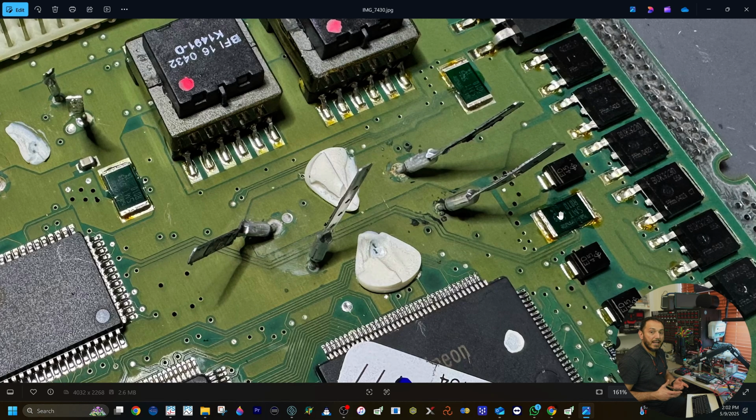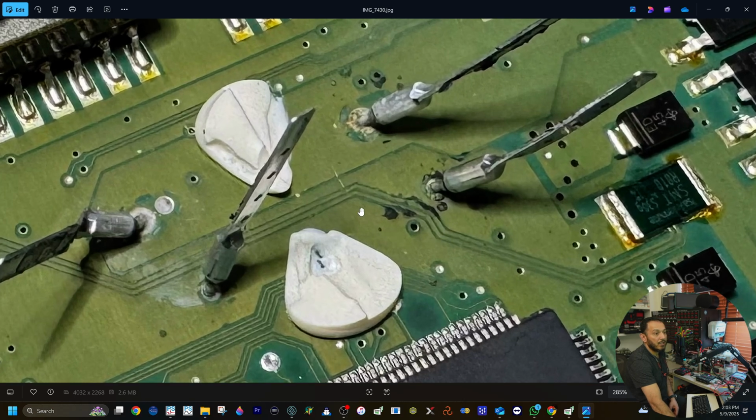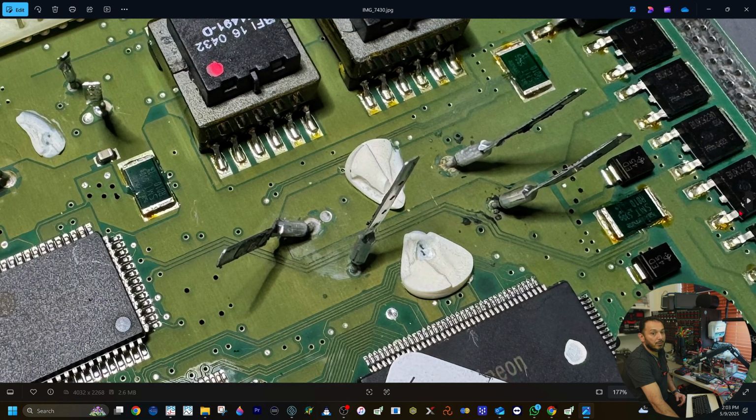They start with age to leak, and they start to damage all those pads, because if you see right here, those are very thin lines, and those are communication lines that go from one component to the other. The one on the bottom, with a whole bunch of legs, that's the main microprocessor on this module. So if that acid reaches there, goodbye, right? If they explode, goodbye, right?